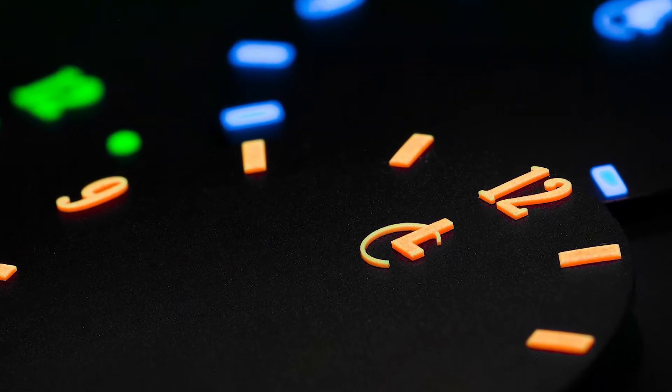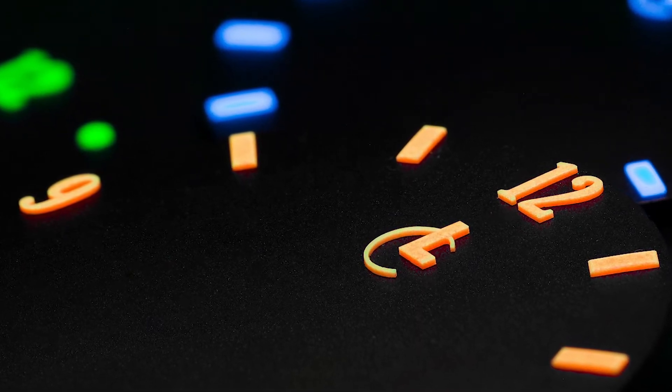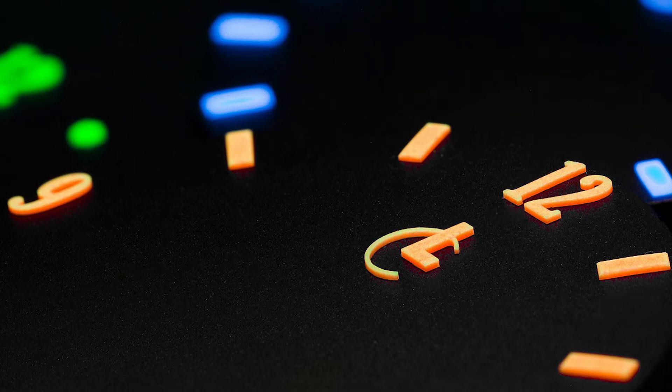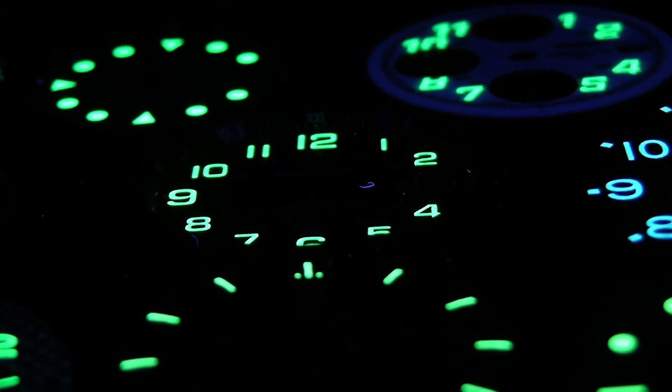You need a positive, and from this positive you take a mold. That mold is usually made with silicone. So then you have a pot where you fill in the sand — in our case, it's filled with Super Luminova, highly concentrated with only a little bit of binder. Then that built-up mold is dried, hardened, rectified so that it's completely flat, and then transferred to the watch component, taken out, and you have the piece on top. It opens quite a lot of new possibilities.